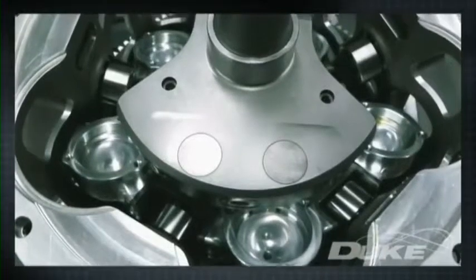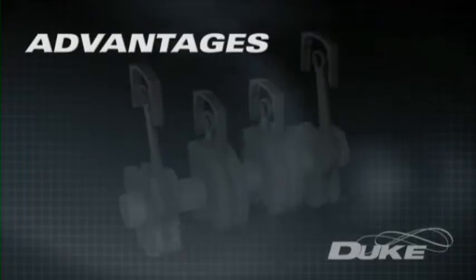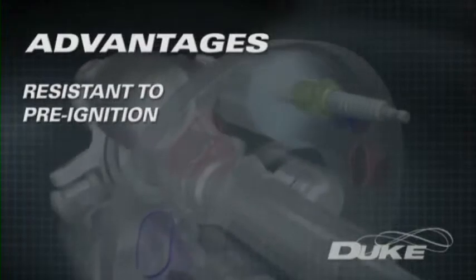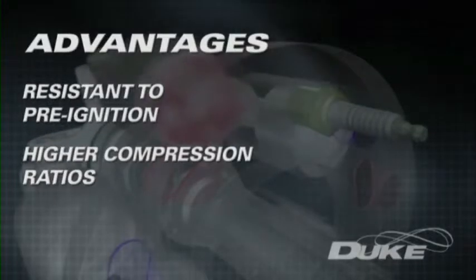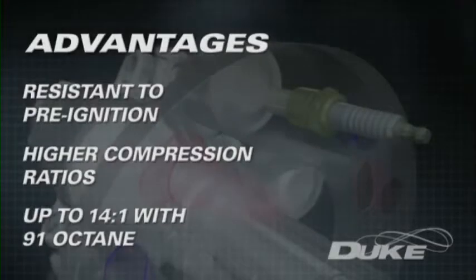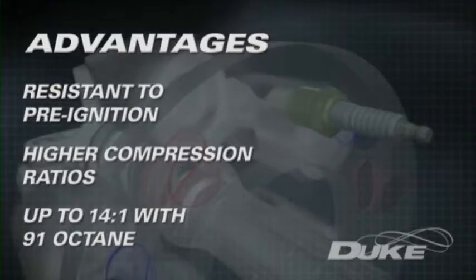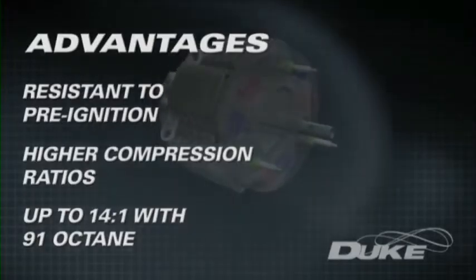Duke's developing engine technology enjoys a number of fundamental advantages over conventional 4-stroke internal combustion engines. Its compact combustion chamber has no hot exhaust valves present and is remarkably resistant to pre-ignition of the fuel-air mix. It can utilize a higher compression ratio, delivering greater power for a given amount of fuel. Spark ignition Duke engines have run compression ratios as high as 14:1 on 91-octane fuel without detonation, delivering a large improvement in efficiency that leads to lower fuel consumption and hence lower overall greenhouse emissions.